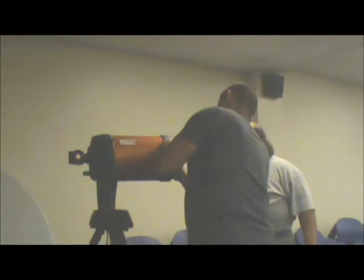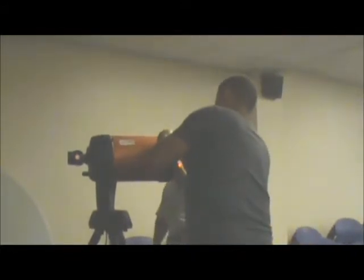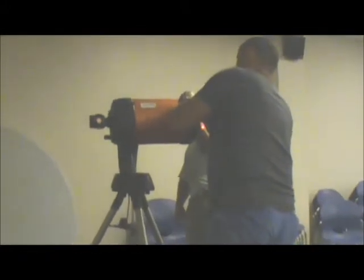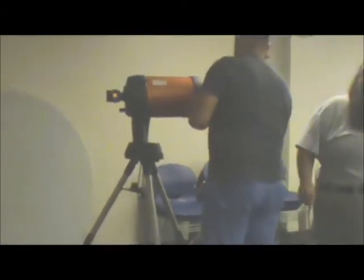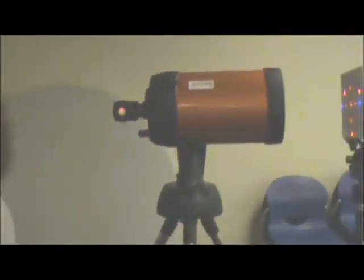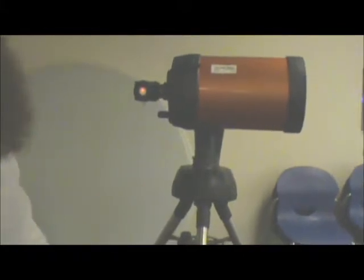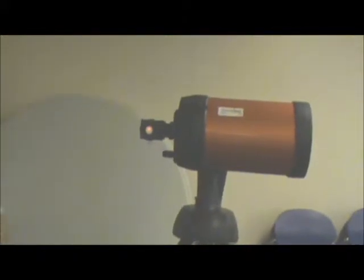Oh shoot, it's loose. One of your screws is loose. And look, see the crosshairs on your focuser? Watch it as I move it. Oh, wow. It's just off a little bit. And when you did that, look what it did to the dots. We weren't getting dots earlier. It aims parallel to the axis. So it's just loose. Okay, this is going to be a lot easier than you thought.